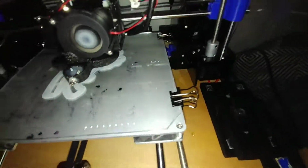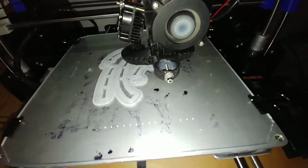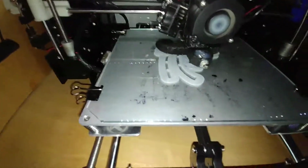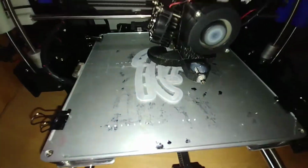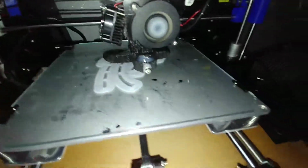Of course, binder clips, mini binder clips. You don't want to use big ones because they get in the way of the mesh. So these little mini binder clips work great. You can just take off the build plate and cool it down. You can run some cold water on the bottom of this guy. When you hold it upside down to get some cold water on it, it pops off easy peasy if it doesn't already pop off when you set it on.